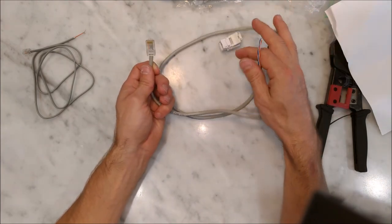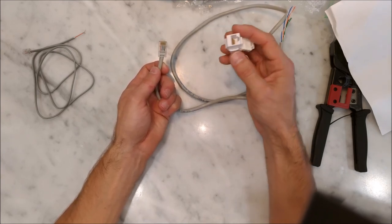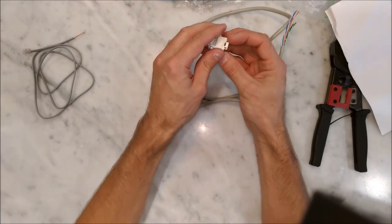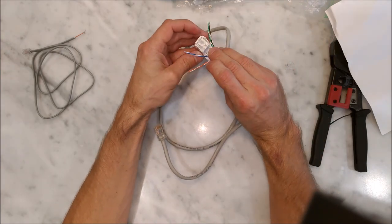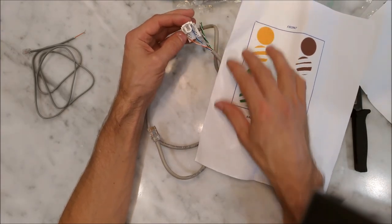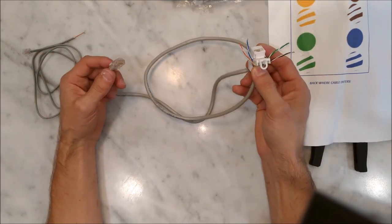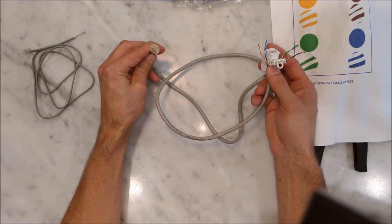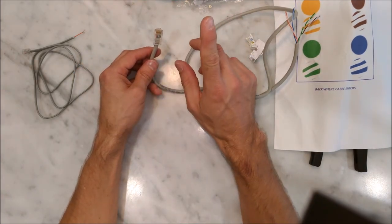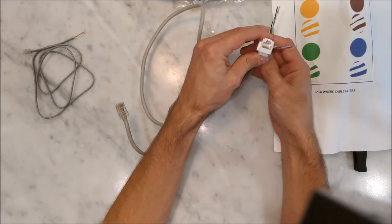You now have a gigabit connection throughout your house. Then on the other end — in your living room, kitchen, wherever — you go in and change out the wall plate from a four-pin plug to an eight-pin wall plug like this. You take that wire and wire it in using the correct wiring code, and again I like to make myself a cheat sheet. With this wire in the living room and this in your closet where your telephone system used to be, you now have an ethernet connection throughout your house. Put a switch in your closet and plug your devices into the wall jack — you're ready to go.